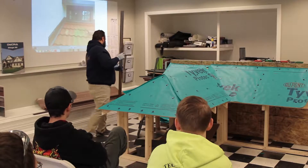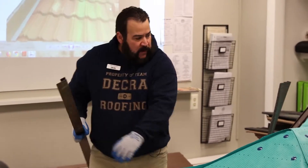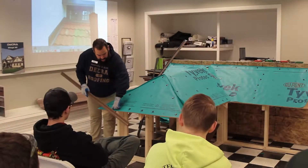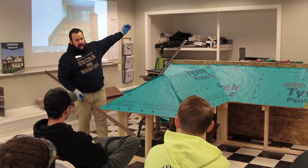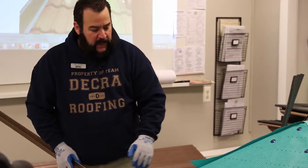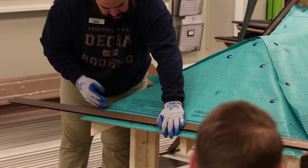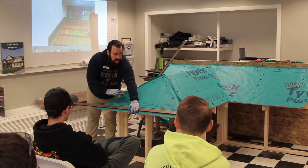So having a straight start is pretty critical. Over the years, through that hard-learned experience, I've transitioned to the other method — running your perimeters with a standard drip edge, whichever width you like, whether it's a straight square edge or with an actual drip on it. We've got our drip edge on, we can put a tape on. Some guys will even pull down from the ridge so you know when you get to your ridge course you're going to be square and level. Snap a straight line, run a butyl tape or sealant right where our screws are going to go on the back side. Set this to our nice straight starter and we know we've got a good straight line, a good solid seal, and we're ready to go.